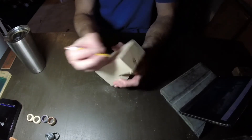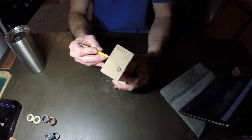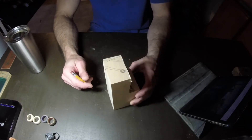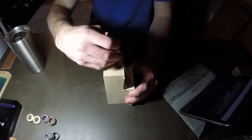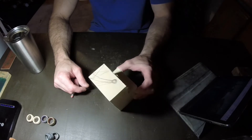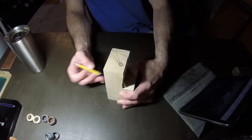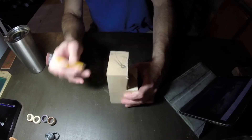I'm taking a look at the angle of the branch and I noticed it's probably not going to work out the way I want it to, so I'm going to have to change the angle. It's always good to sketch things out, visualize it, stare at the block for a bit, and figure out how things are going to work out before you make the cuts — because it will be too late if you make the cuts and then figure out the problem afterwards. There I've changed my angle and there's a little X up top marking what I need to cut out — more of a triangle now than a rectangle. I'll cut that area down and then start shaving out the branch and leveling out the box.